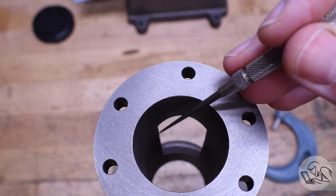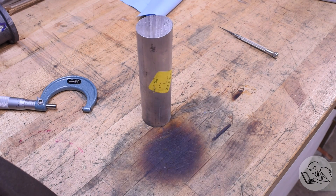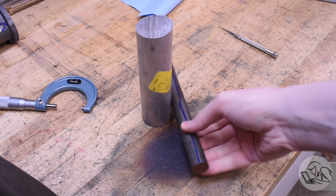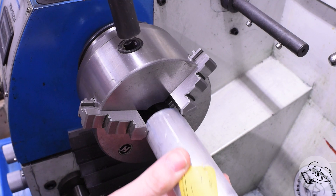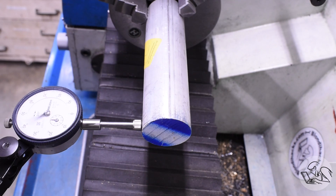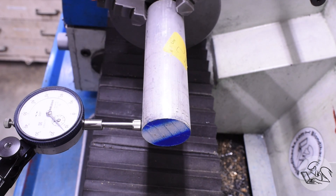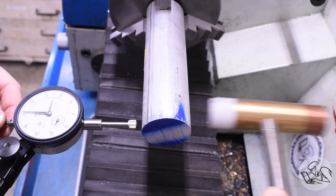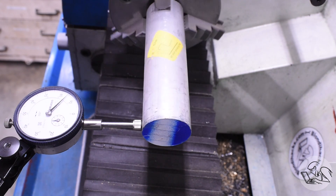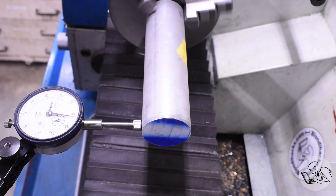While we're here we might as well see if we can improve on this. I've got a chunk of aluminum and a piece of mild steel from the scrap bin which will act as the mandrel for the barrel. I'll chuck this up in the lathe and get ready to do some turning. I'll say up front that the lap I'm making is very heavily based on the one that Mark Presling made on his video about lapping a model airplane engine cylinder - I'll link to that below. I basically just took his design and reduced the part count a little bit.